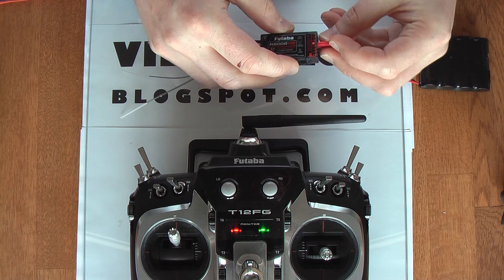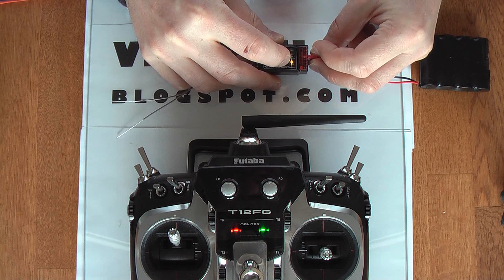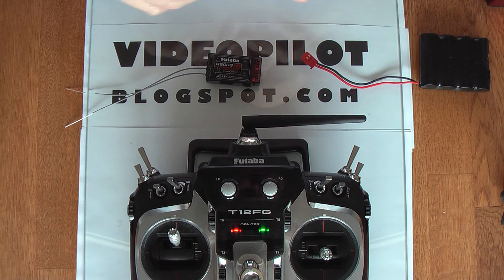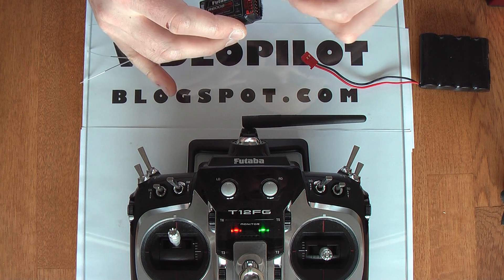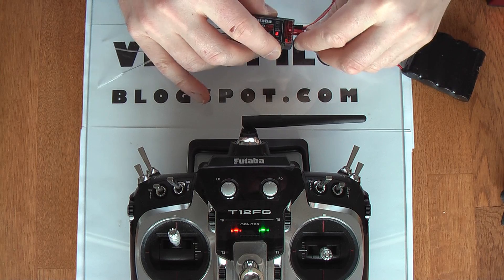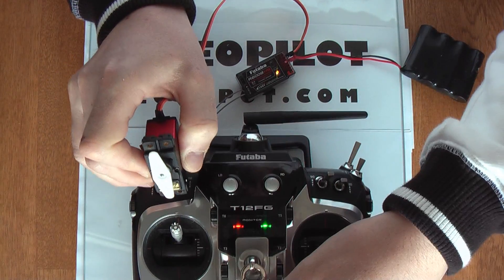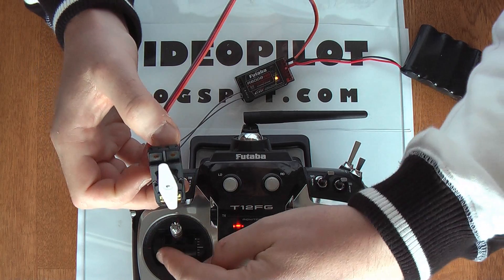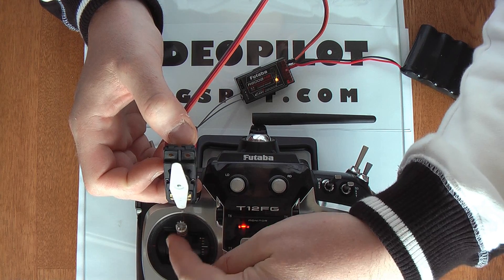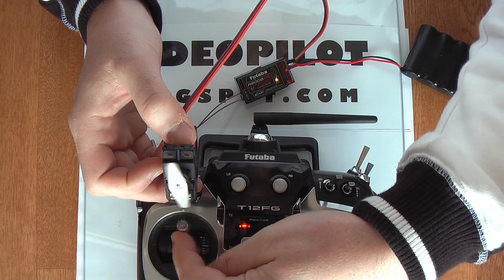To begin with, put the battery into the battery port. Seeing it's in normal mode, we don't get the dual LEDs — just a red LED shortly after switching to green light. If we connect the servo, for simplicity we put it on the second port, connect the battery, and we see we have a certain response time. Comparing it to the stick movement, you can see how it follows with some lag — I get the feeling I can slop it around like a rope. It's lagging a little bit.